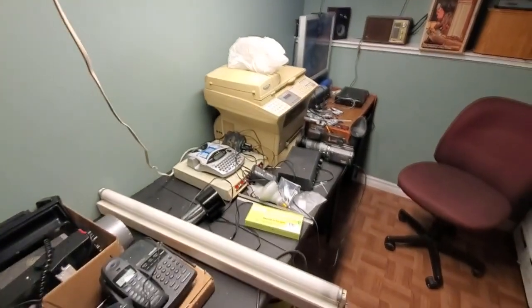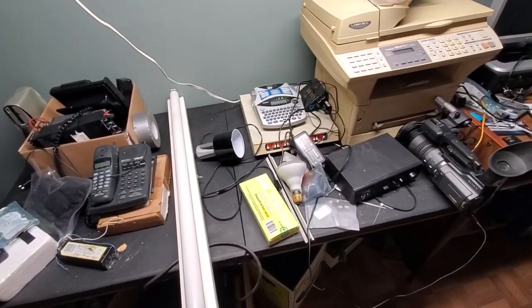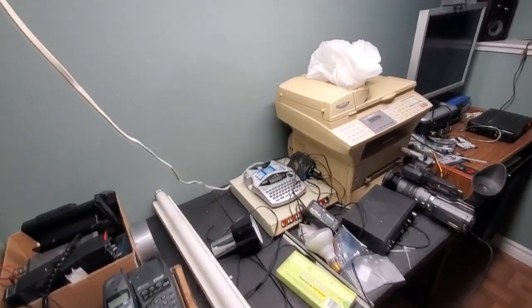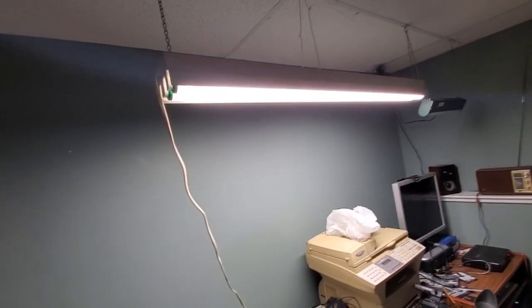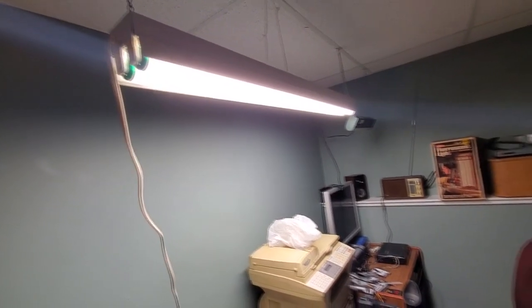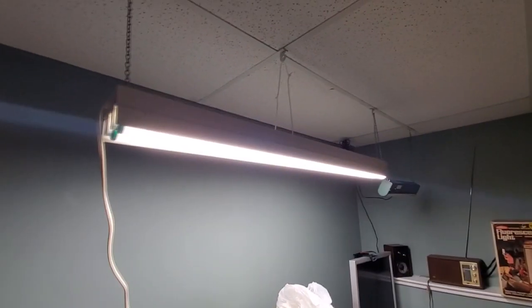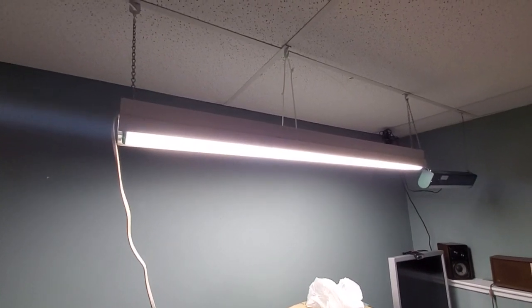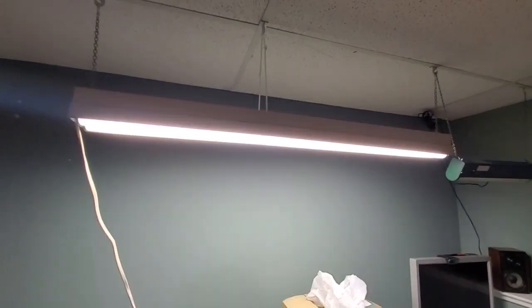So, the other thing is that this thing throws off so much light. It's great work lighting here, but I almost feel like I could do with a little bit less lighting here. So what I'd really like to get is indeed one of those Advance HB234TP ballasts. Weaker ballast, not as much light, also a physically smaller ballast, so it's going to be lighter in weight. Problem is, I went on eBay, not a one on eBay. Last one sold in October for $2. Darn it.